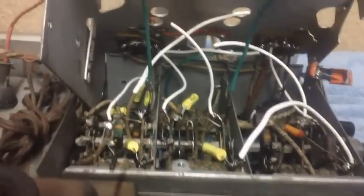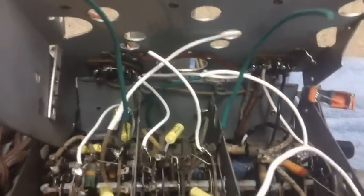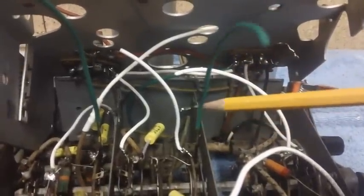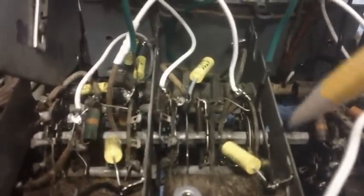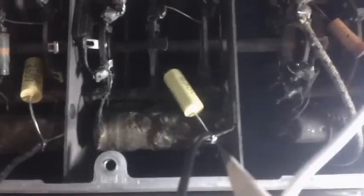So as far as I'm concerned from this experiment, clear nail polish has no negative effect on beeswax around these coils. All the pieces of wiring that'll pass up through this RF chassis top plate have all been attached where they need to go — they're plenty long enough to feed through without any problem. These two green ones I attached to the short black ones — just some scrap wire I had laying around. Once it's passed up through, they'll be removed. Now, up here on the coils, this stuff is really ragged.